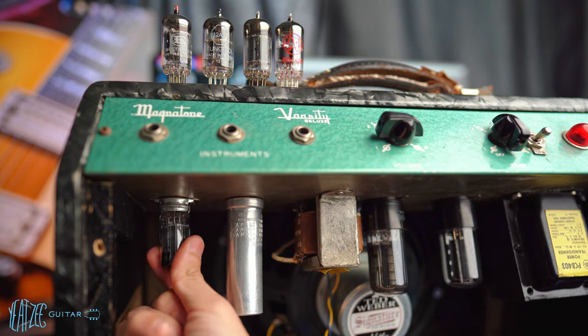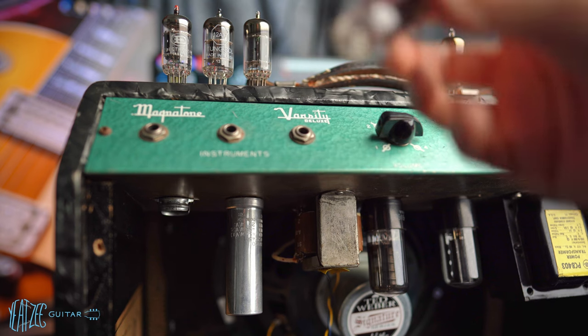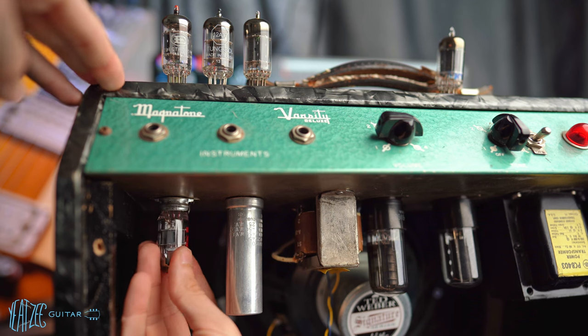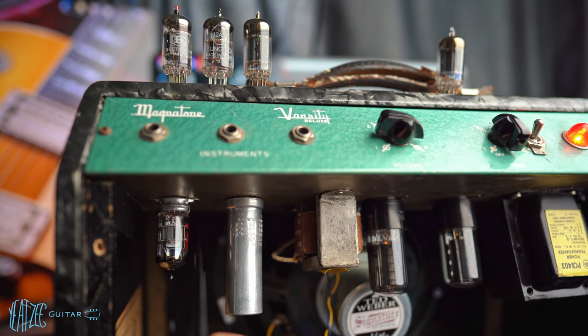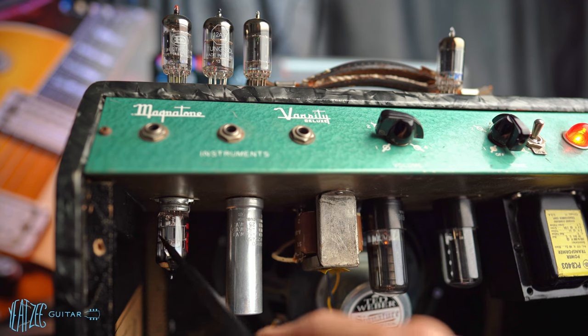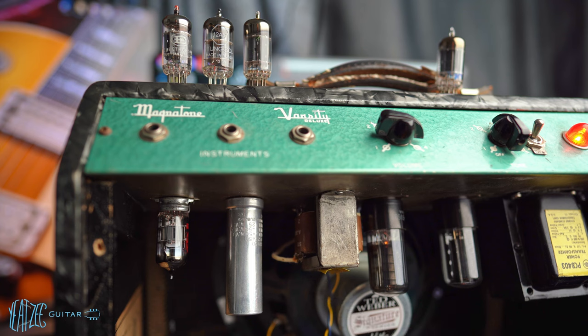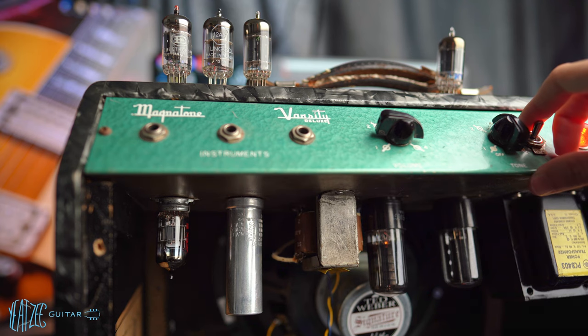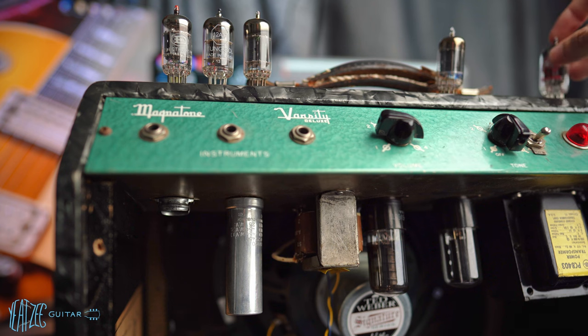It's cooled down so let's remove this. There's no branding on this tube so I don't really know what it is. We'll start with the JJ because it's brand new, so I'm assuming it should be fine. Let's turn it on and tap it — nothing, dead silent. While I'm here, just to demonstrate the can cap issue from episode 2 — if I move this it makes crackling noises. So that's what we'll be fixing after we confirm which tubes work. This JJ looks good.